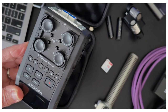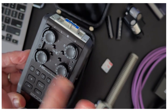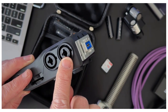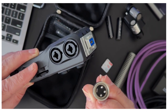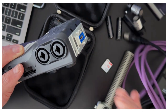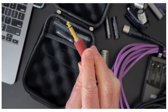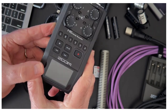There are some buttons in the center of that array of good old-fashioned analog knobs. It's called a pad, and it says 0 to minus 20 dB. What that will do is create a reduction in input volume or gain. These inputs are dual inputs — they will take an XLR input, which is pretty standard in the audio industry. If you're a musician or singer, you've probably seen this kind of jack. But these are dual jacks and they will also take a quarter-inch style, which is typically a guitar jack, keyboard, or other instrument.